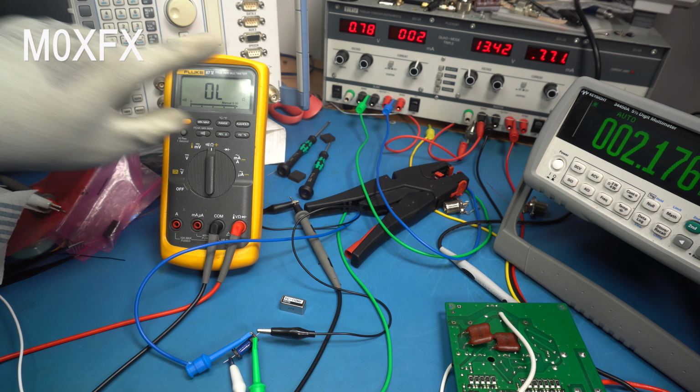basically what he's saying, he's had the same problem. He couldn't find any information on the unit itself, this TC112MV device. And he's basically put one in here. It's half amp stroke 150 volt switching. This is the one he's put in there, and you can see here he's put some characteristics of the reed relay.